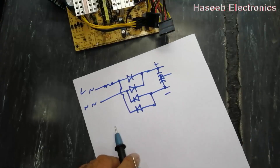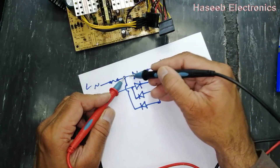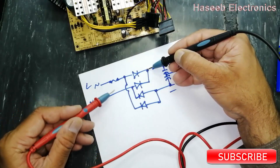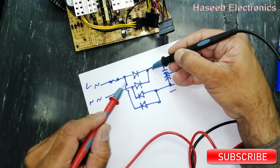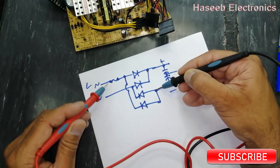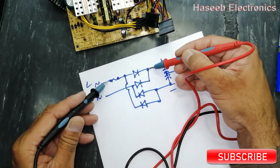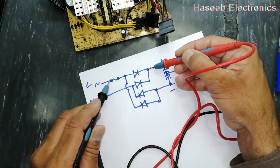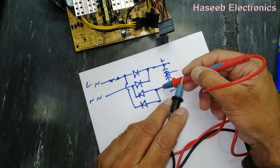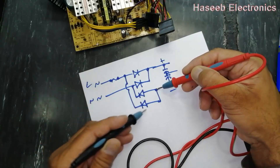Before applying power, we have to verify this bridge circuit. Connect the black lead of the ohmmeter or diode meter at the cathode and the anode — this diode should give a voltage drop. Connect the black lead at the positive terminal, red lead at one line, then red lead at the second line. The multimeter will show the voltage drop of these two diodes. If you reverse the leads, both diodes will be reverse-biased and we will find open circuit. Swap the leads: connect at the two cathodes — those diodes will reverse-bias, giving open circuit. Move the red lead (positive) to the anode and we will find the voltage drop of these two diodes. Let's check.